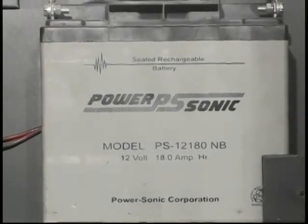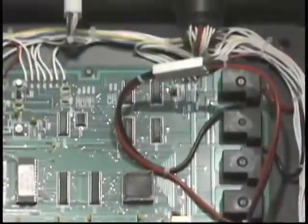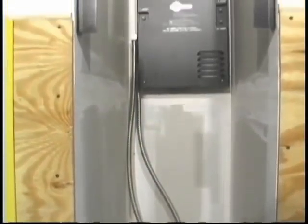Independent tests show that a fire guard door installed in a 17-by-9-foot opening still completed 50 opening and closing cycles with storage battery potentials at 11.5 volts. The batteries are sized so that even after loss of AC power, they can still supply sufficient power to the logic board to continue monitoring inputs and responding to them for up to 63 hours.